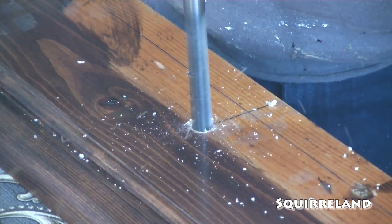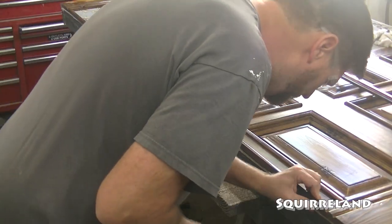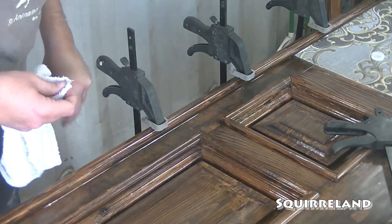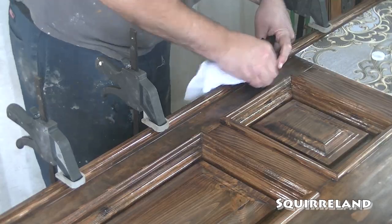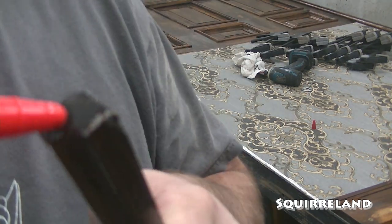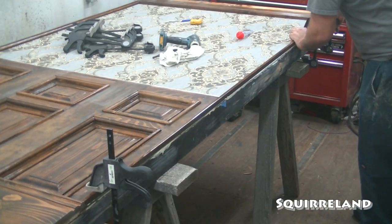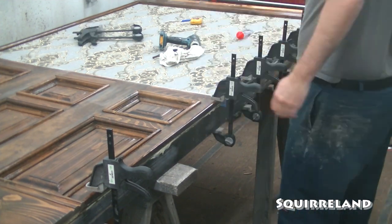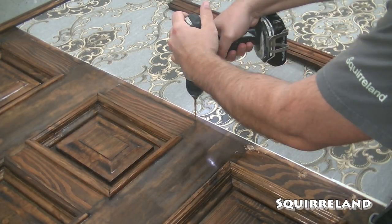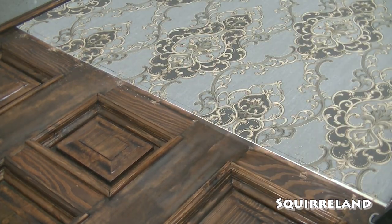These holes are how the removable crown molding will bolt to the panel. Because the side trim boards are so thin, I went with gluing them in place instead of using the nail gun with finishing nails. I also used silicone seal on the end of the boards to make a watertight seal. I again checked the front of the boards and cleaned any squeeze out with a damp paper towel. I then repeated all of the same steps on the other side of the panel. The last trim board — I marked and drilled pilot holes across the middle of the panel, clamped the chair rail in place, and put screws in from the other side of the panel.